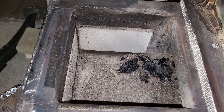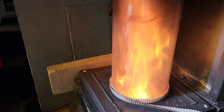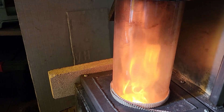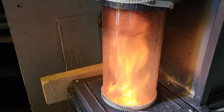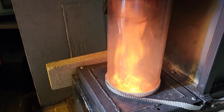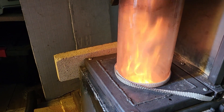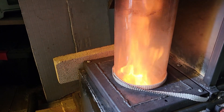I might put a little piece in here but I suspect it will get knocked over very quickly. You can see the tertiary burn working incredibly well. This is roughly what I'm after as far as burn rate goes — it's not very fast in my uninsulated cabin and I want a long slow burn, not a fast hot burn. This is with the damper just about all the way off, or all the way plugged. This is kind of the effect, but I just don't know that I can sustain it, to be honest.